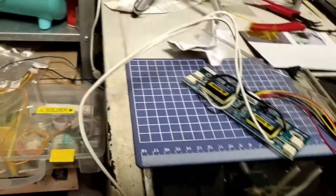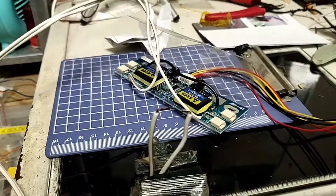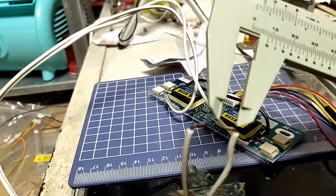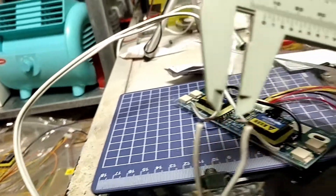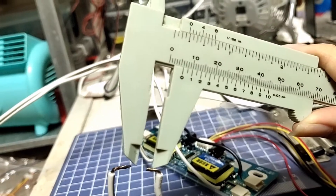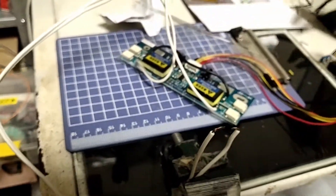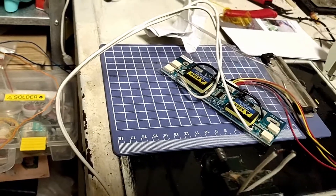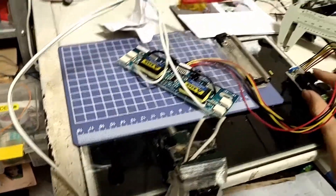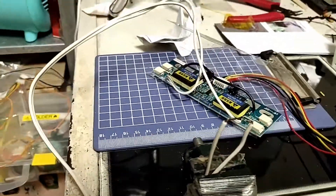This is the wire that will be the output. Let's measure the distance across — that will be about six millimeters for the arc to travel across. I can approximate this to be 10kV if the arc is able to jump across this distance.